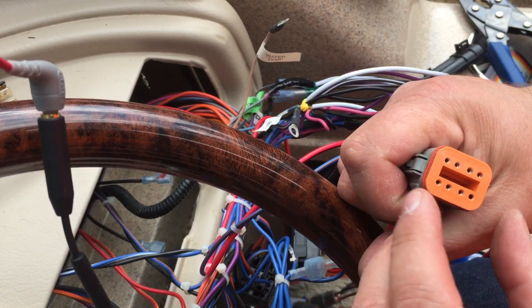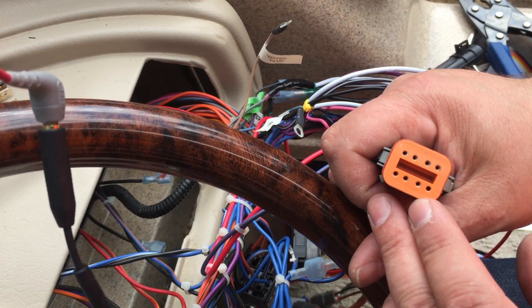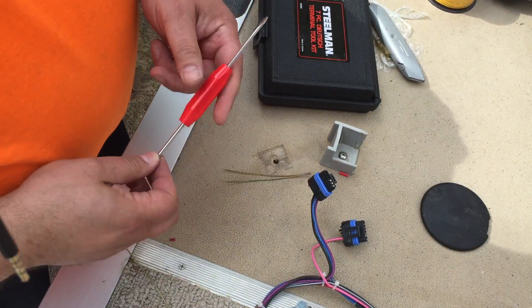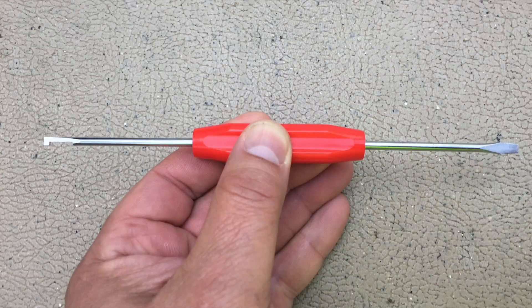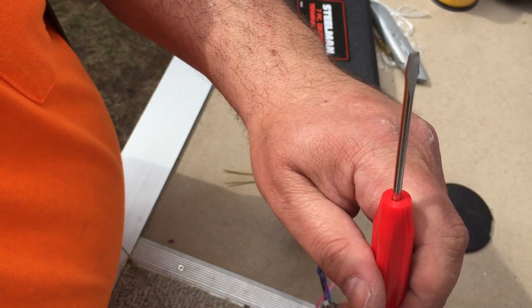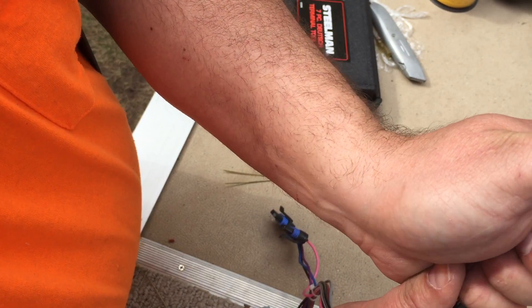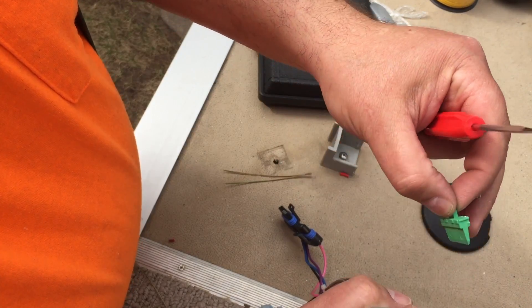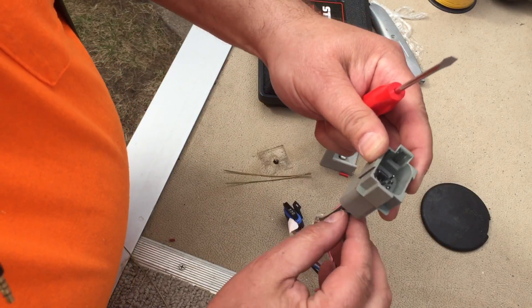This is ready for the male side — I have to repair the male side as well, but that's going to happen off the boat. The tool you use is a Deutsch tool; it's got a hook in it and its whole purpose is to grab that green splitter. It causes a wedge to keep the pins stuck in there. Then I'll start replacing the gray wire here.